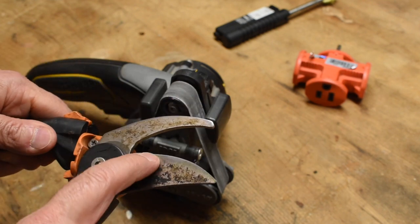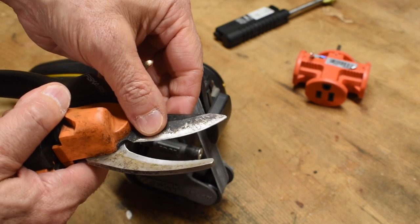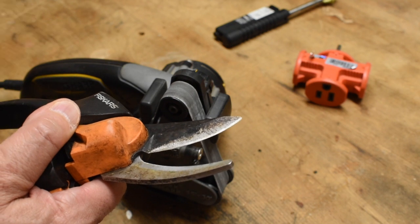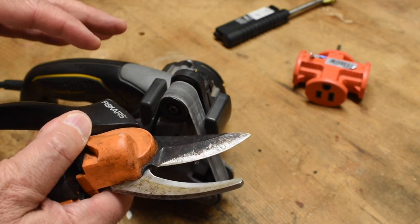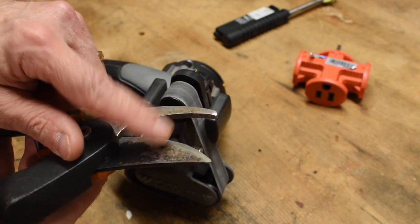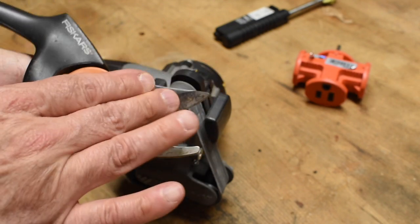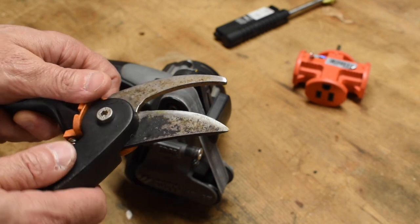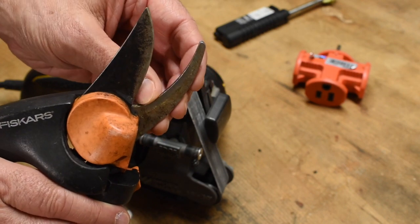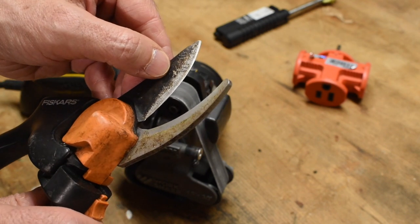Keep in mind, there's a flat side and there's a beveled side. This beveled side has a grand bevel and then a fine bevel. The best approach: that double-sided sharpener, the stone thing, the other Fiskars thing — don't use it, it's not going to work. It's going to try to sharpen the flat side, and if you attempt to make the flat side sharp on a one-sided bevel sharpener, you'll destroy it. It relies on this flat side coming in contact with this edge right here. What you want to do is make the beveled cutting edge as sharp as you possibly can.